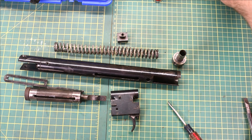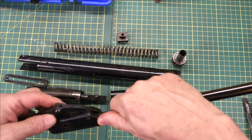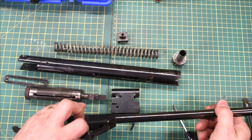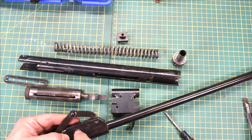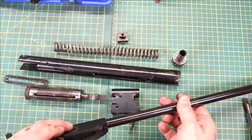And yeah, this is the barrel right here. And the cocking linkage, just a beautifully rounded and polished rivet there. You gotta love that. That one's pinned in place. These are little gaskets. Last year I had those out. Underneath here you pack it with lubricant, put it back in, it keeps it nice and tight.